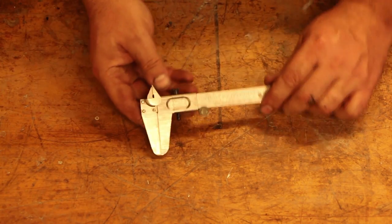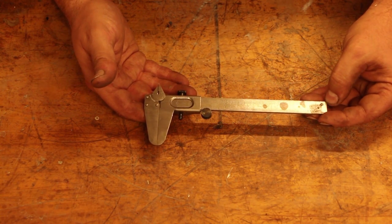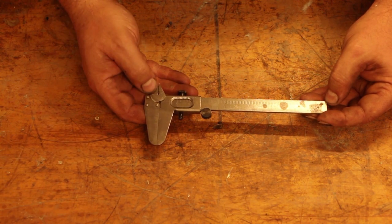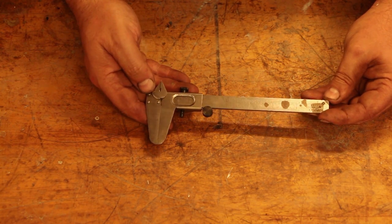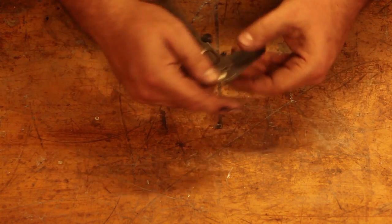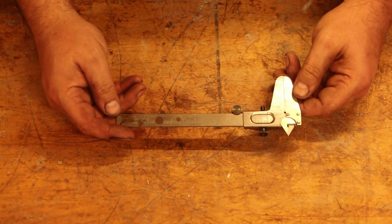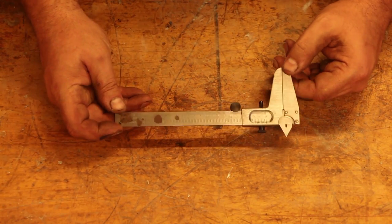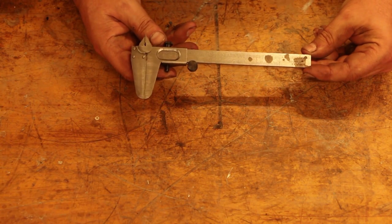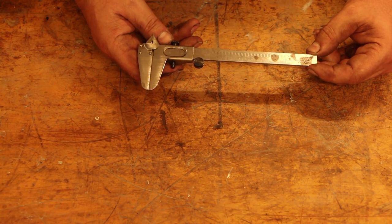It's actually a pretty nice pair of these, very well built for not having the precision of measuring to 1/1000th of an inch. A lot of these that you see now are made out of plastic. A lot of woodworkers have similar types of these because they're not interested in measuring to 1/1000th of an inch or finer. But this is a very nice set indeed. So anyway, I'll put this probably with my woodworking tools as well. I use my machinist tools to measure in woodworking all the time, just because I'm used to doing that and I have them, so why not use them? But really and truly, measuring to 1/32 of an inch in woodworking is usually good enough. So anyway, we'll use that in my woodworking.